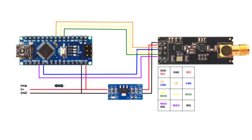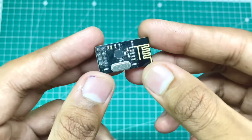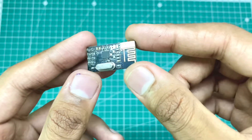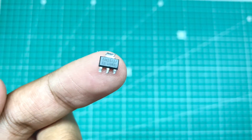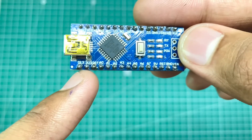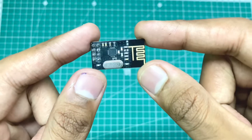This is the circuit diagram that you have to follow. Be sure to give a supply of 3.3V to the NRF24 module, and that can be fed by an AMS1117, because you can't connect the 3.3V output pin of Arduino Nano as it doesn't provide enough current for this RF module.